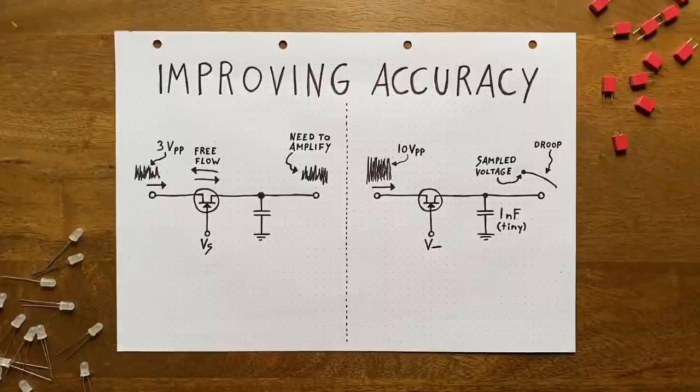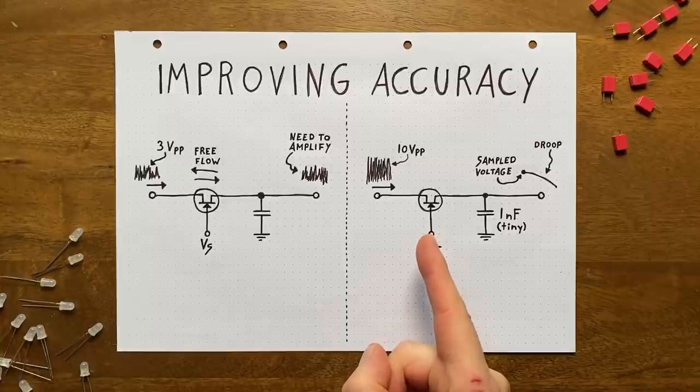The downside of using a very small capacitor stems from the fact that every capacitor leaks. This means that even when there's seemingly no way for the charge to leave the cap, it will do so anyways. To try and avoid this, we can use capacitor types that are described as being low leakage, but those will still leak. We're dealing with real things here after all, and real things are never ideal. Even our JFET will let a tiny amount of current through when it's supposedly closed.